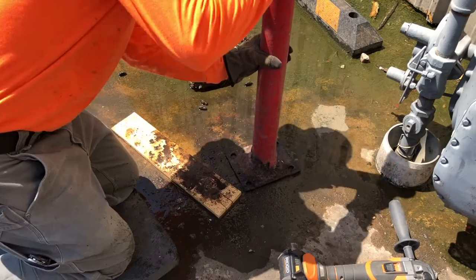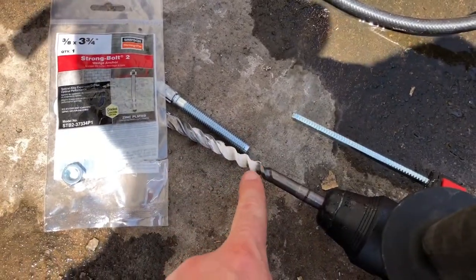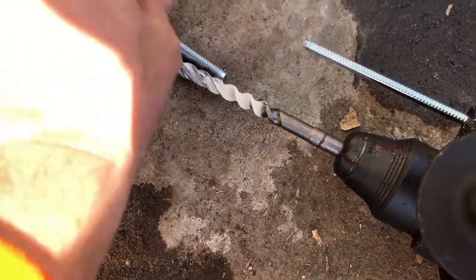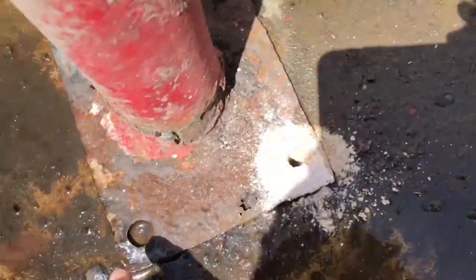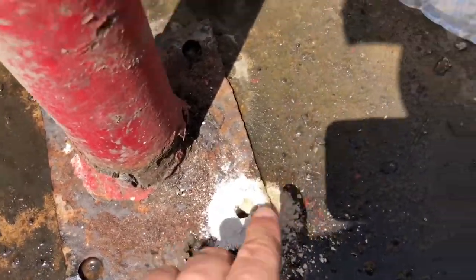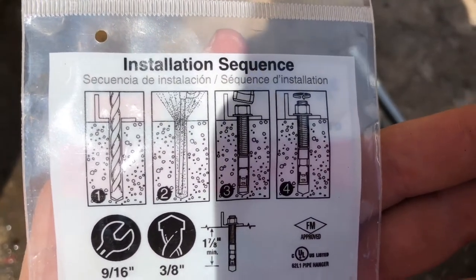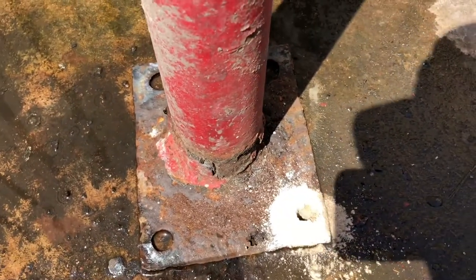For this part I already adjusted my depth rod to where I drilled the first hole right here, and I can see where the line is — it matches up with about the depth of the bolt. You want to give yourself at least an inch above the line there, just so you have something for your nut to catch on. We're gonna drill the other three holes, then with the air compressor we're gonna clean out the holes, because it's highly recommended with these Simpson Strong-Tie wedge bolts. It shows you right on the back how to do it — you drill out the hole, clean it out, knock the bolt down on top of the plate, and then tighten it down and it should hold securely.